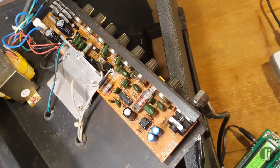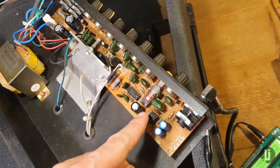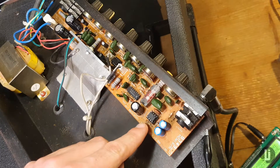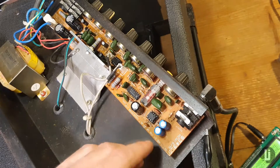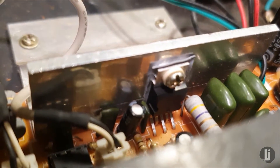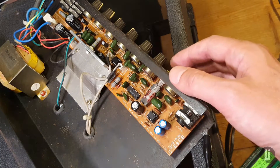Looking at the board, there's nothing remarkable here. It's a single-layer PCB with your usual suspects. There's a TL072, which is what you find on pretty much any solid-state amp — it's on at least half the pedals out there. It's a dual op-amp: two clean stages, signal goes in and comes out louder but clean. Then it goes into the power stage, which is a TDA2030 — what you find on Marshall MGs, Orange Crushes, stuff like that. That is the full clean channel.